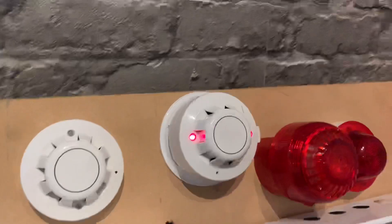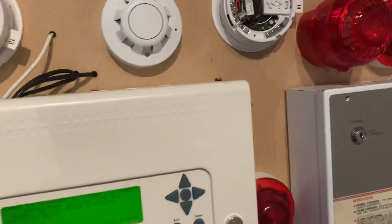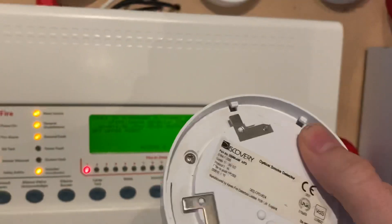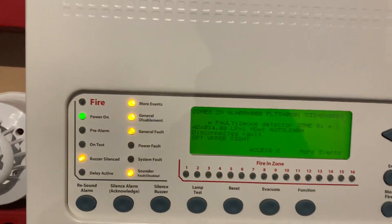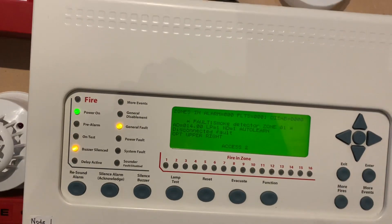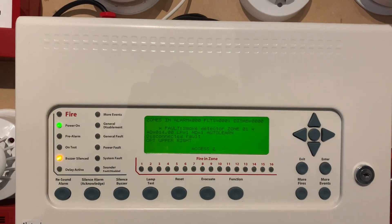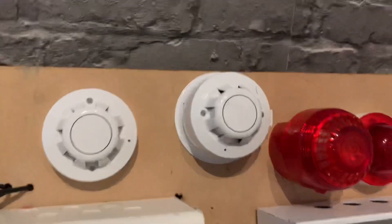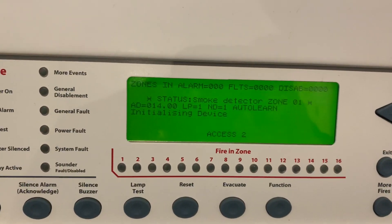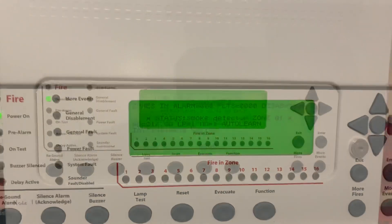You can see the detector chamber hasn't quite cleared yet, so I'm going to take off this head and just leave it down there. I'll put it back on and wait for it to re-initiate on the loop — it's a discovery one. Reset — there's a fault, that's why it's beeping continuously. Go to view and restore, re-enable it, put the head back on. You can see it polls quite fast when you put discovery back on. Now it's initializing the device.